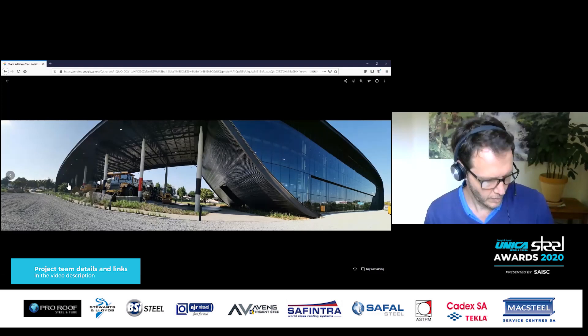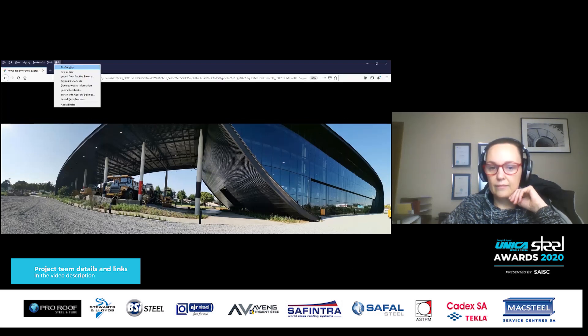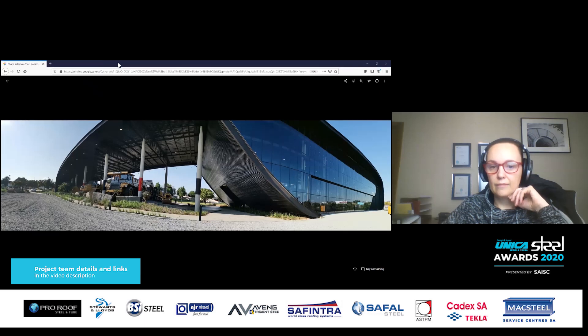Can you give us a brief description of the cladding used on the structure in terms of material and profile? We utilized the fourth generation concealed fixed range in South Africa, now called TipTight, for roof sheeting in 0.58 thickness charcoal gray, rolled in continuous lengths on this roof. The sides were done in fish eagle white using corrugated 0.8 galvanised sheets that had to be painted on site after erection. The corrugated was used internally as well as on the sides of the building where it's painted in charcoal gray.